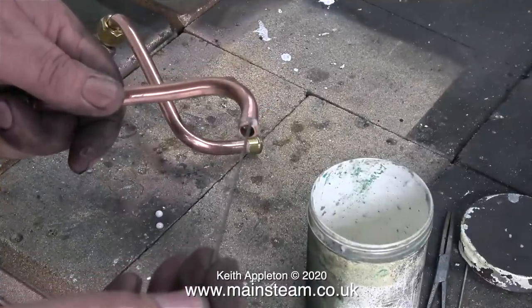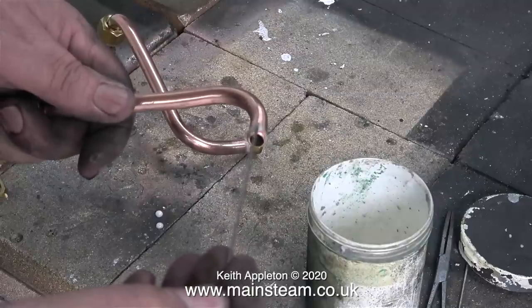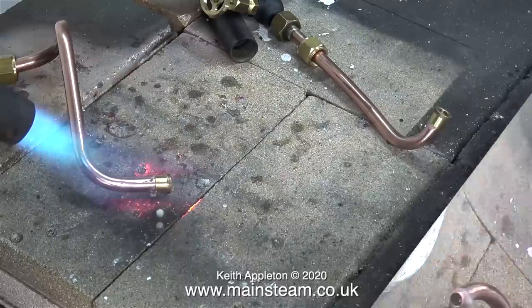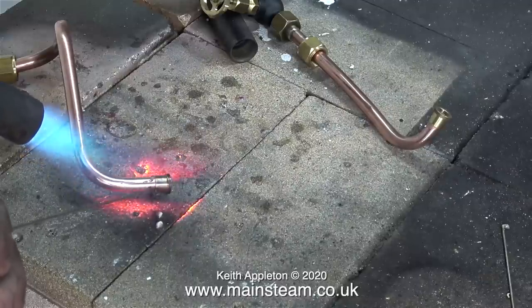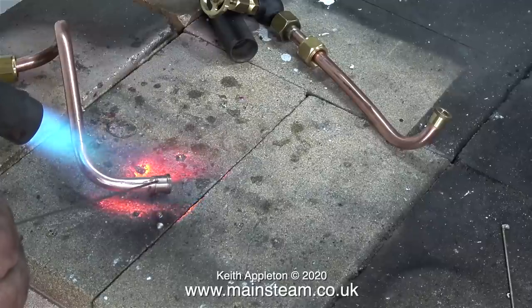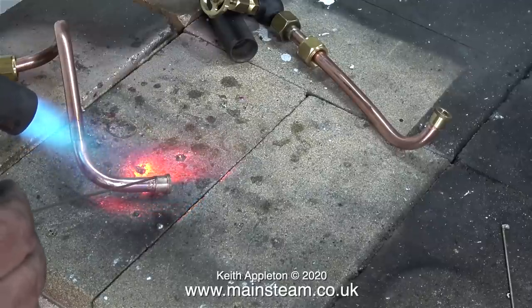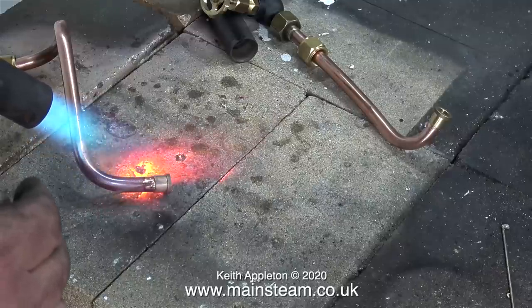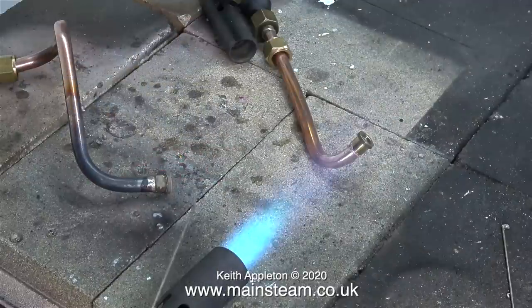The time has come for a bit of silver soldering. I'm in the outer part of the workshop and I'm coating the pipes with flux. Once I've fitted the second brass union, let the silver soldering commence. Just in case you haven't noticed, I'm using a larger blowtorch nozzle for this — this is much larger pipe than I would normally silver solder. The principle is identical to smaller pipe: I wait until the flux takes on a watery appearance, then I apply the silver solder, hold the heat on for a short time afterwards, and then that's one done.